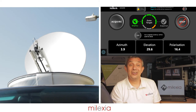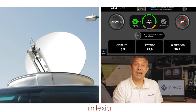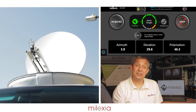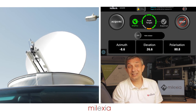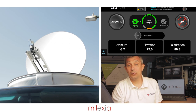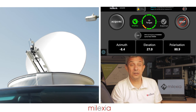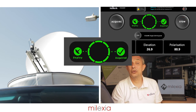If your reference and target satellites are different, once the reference has been successfully identified, the AIM can then drive the antenna to the target satellite position, changing the polarization and LNB settings if required. Once again, to achieve maximum signal strength on boresight, the AIM will perform a peak function on the target satellite and compare information to confirm we are locked and acquired on the correct satellite.